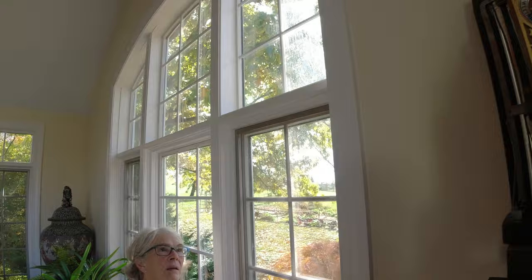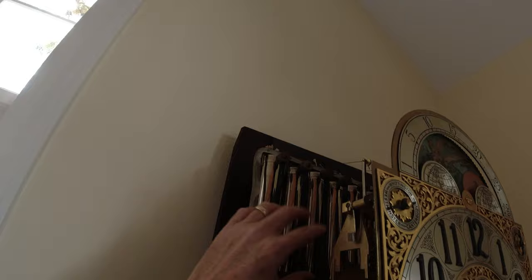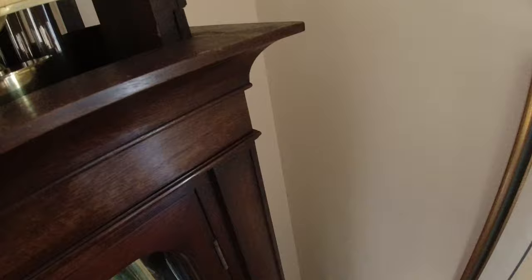The way I set it up is to try to keep them off the tubes a little bit. They can be adjusted to a certain extent with these knobs here. I don't think it's really needed because all the notes sound good, but this is what adjusts the tension. You can make it more forcefully hit the tubes, but you don't want to put too much strain on the movement because it may stall out. So there's a fine line you have to walk there. So I'm not going to mess with those. They appear to be fine.